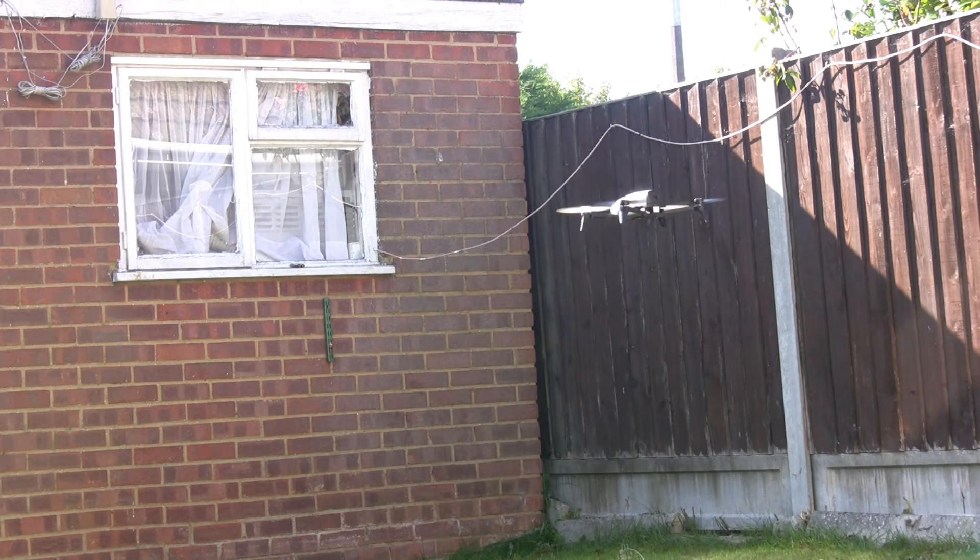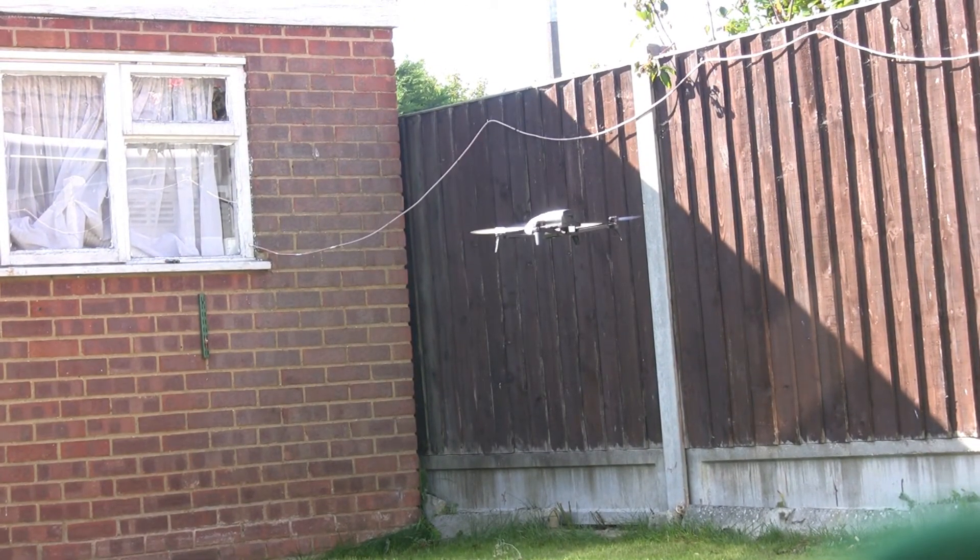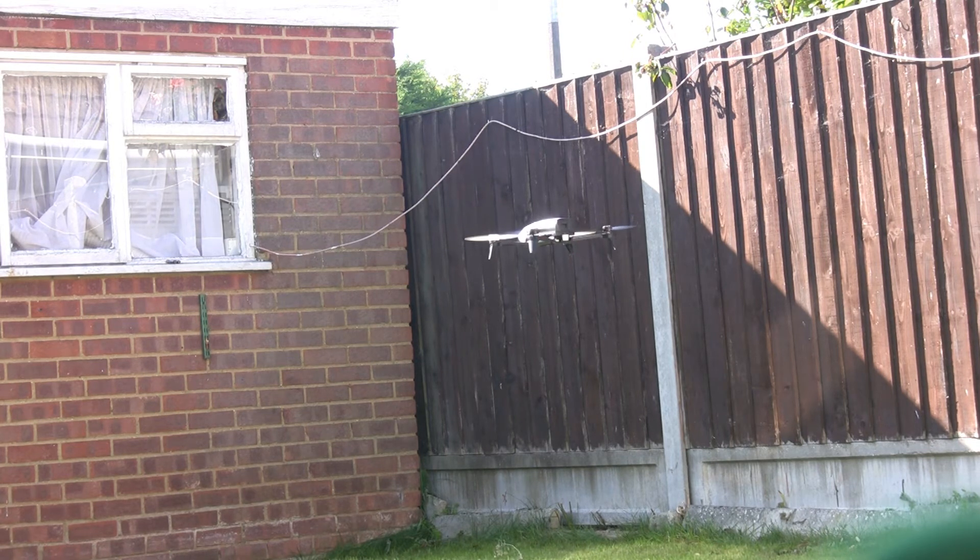The chip is next to the CPU and it's filled in with what they call underfill. So I scraped the underfill off and then used a heat gun to remove the power management chip, and underneath there was corrosion — which surprised me a bit. But then again it had been sitting around for two or three months, so one would assume eventually the corrosion set its way through. The power management chip itself had multiple shorts on it. With the chip off the board, the shorts around the area I was measuring disappeared, which pretty much nailed that down. Unfortunately, getting hold of another one of those chips is uneconomical and they're really difficult to get hold of anyway.